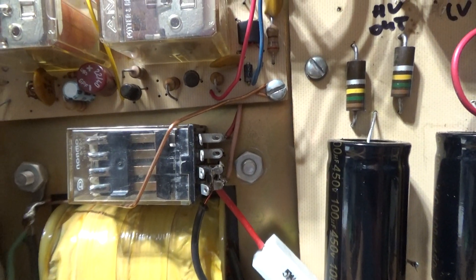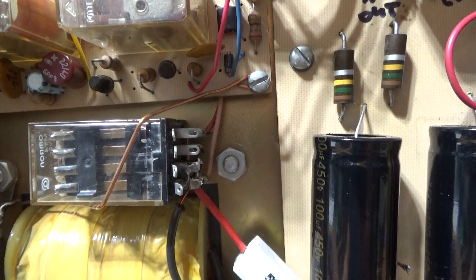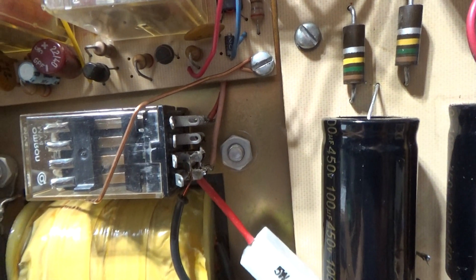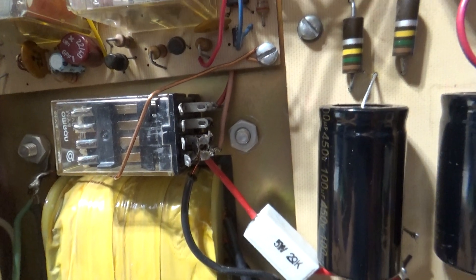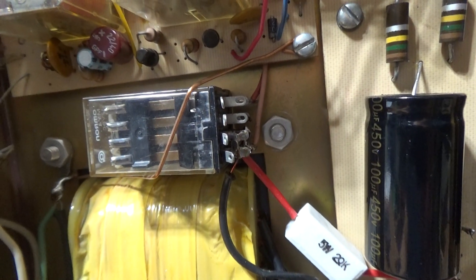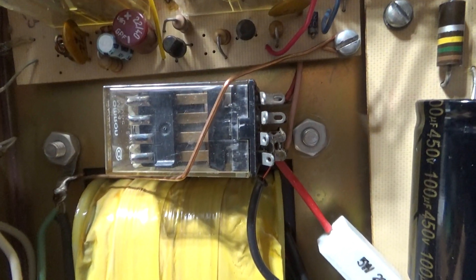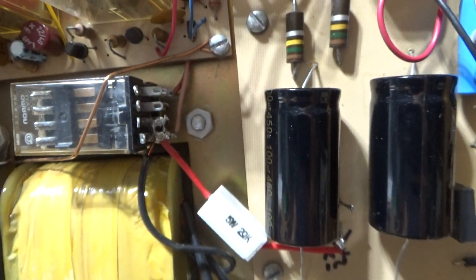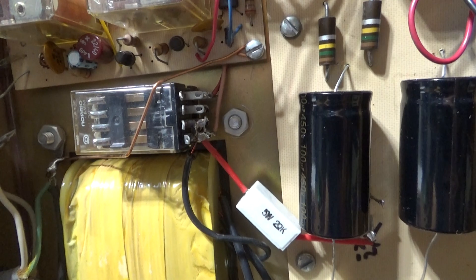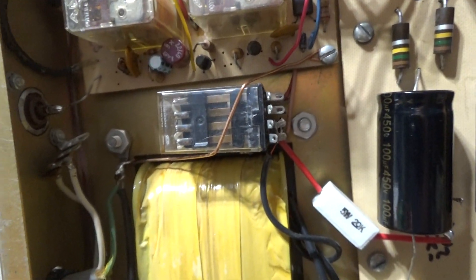Some of the later Palomars, like the 300A, didn't have any cutoff either, but then they added it. So some of the early ones, you don't see the added relay to cut off the high voltage, but the later ones did — which is a good idea. Somebody put in this relay here to cut off the voltage. When you key down, that relay keys down, and the high voltage from the transformer winding comes in through that black wire and out through that red to that resistor. So the high voltage is only applied when you key down — that kind of fireproofs this amplifier. Very good mod.